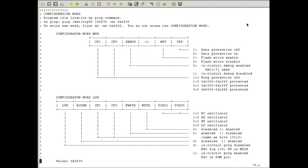Let's take a look at the driver code for the DL1414. First thing before writing any code is to figure out what your configuration word needs to be. CP1 and CP0 control the banks you protect in flash memory — we're not using code protection so we set these to 1. Debug is disabled, set to 1. WRT is flash write enable — we're going to enable flash for programming so we set that to 1. CPD is data protection for your EEPROM. All these bits — CPD, WRT, and the CP bits — work together, so refer to Table 4-1 in the 16F876 datasheet to understand what's protected and how.